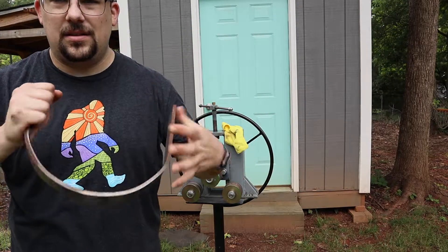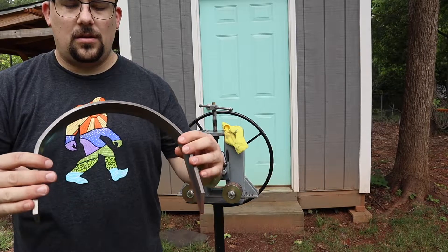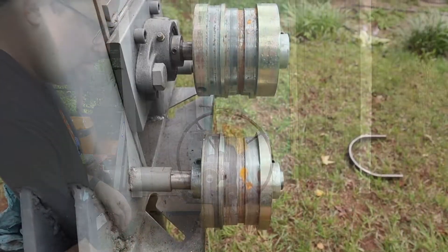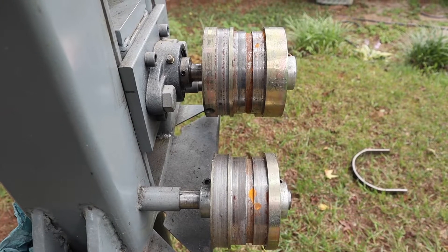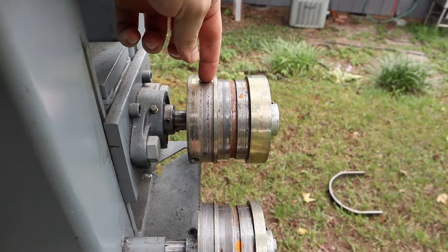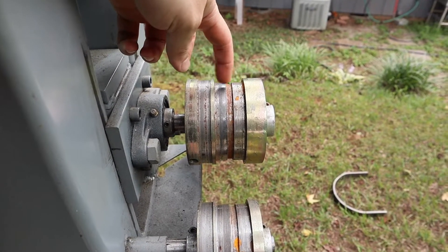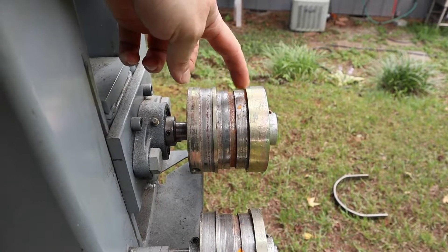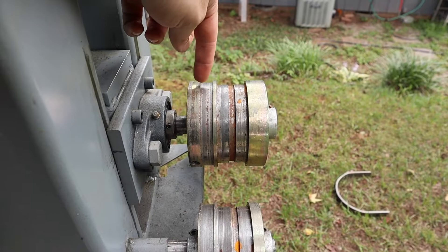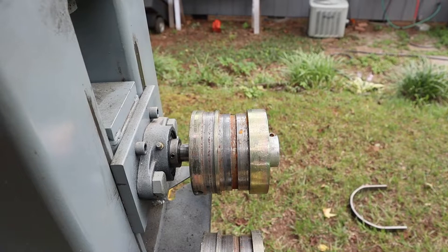That's quarter-inch steel, one and one-quarter inch. And that's what this will produce. I have different grooves on my rollers. This one is for square half-inch stock or seven-sixteenths stock. This is for one and a quarter. This right here is for quarter inch. To be honest, I really just use this one and this one — I don't try to get the quarter in there.